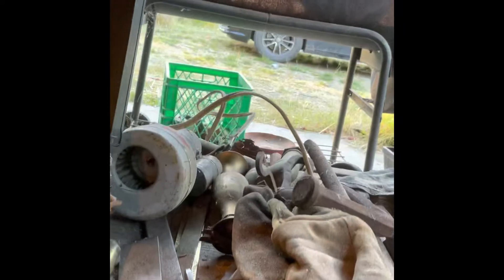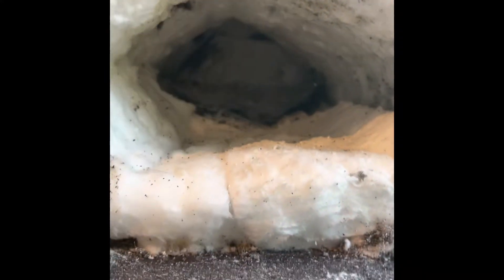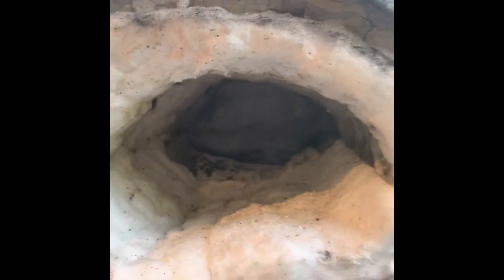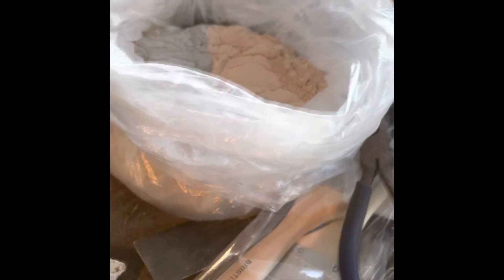You can see it wasn't too bad, but there are some sections that were kind of flattening out and wearing off anyway. So I'm just gonna put another layer on, especially right in the front. I painted it with water — just regular water — and then I'm gonna coat the inside and the edge with this satanite refractory mix. I should have enough, I think.